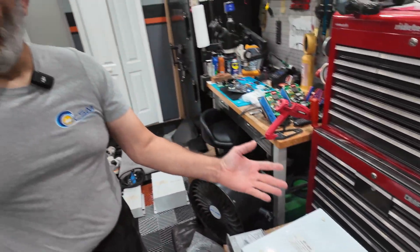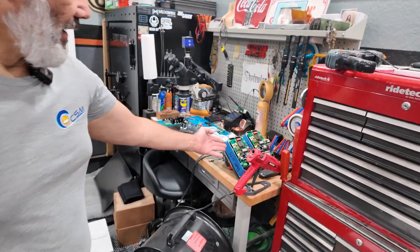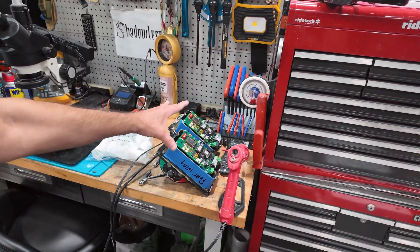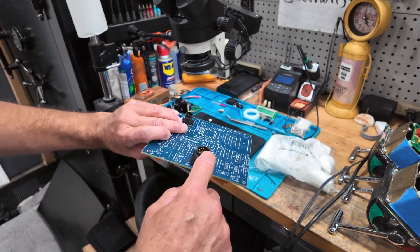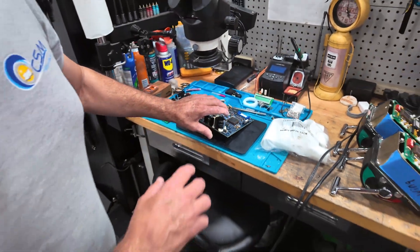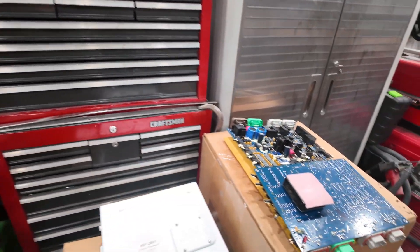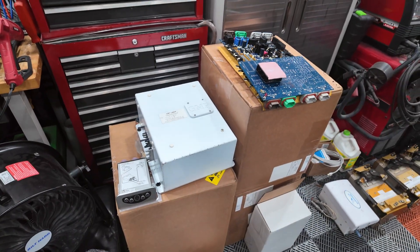We also have Cobalt control heads here on the top that need to be reprogrammed — the boards went bad and we reordered the parts from Cobalt in Canada. We put them back together and will program them. This is a station processor we go through: we verify all the solder points are fine, then test the two capacitors, because half the time the capacitors and the chip go bad in these. We try to spend minimal time repairing, but if needed we'll go deep on these older systems for customers who don't want to update yet — though there's a limitation on how far we can go.